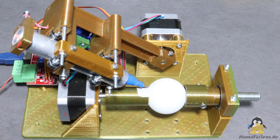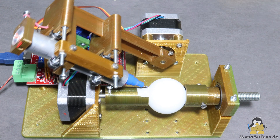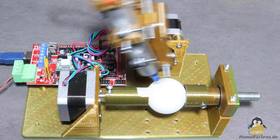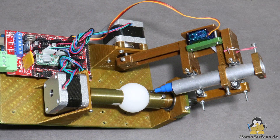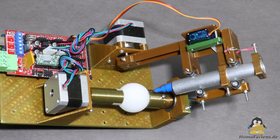The two stepper motors for the X and Y axis are arranged so that the motor axes cross at the center of the object to be painted. These objects can be attached to the Y axis with spacers so that the axis of the X motor runs through the center point. Double-sided tape ensures that the workpiece rotates with the Y axis. The arm with the pen is attached to the X motor. The pen is pressed onto the workpiece via a rubber band so that an uneven surface doesn't cause problems. The pen is raised or lowered via the servo.